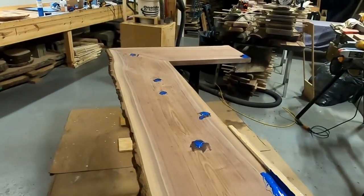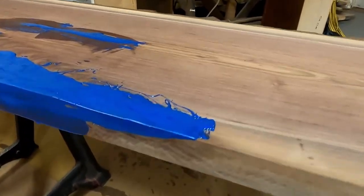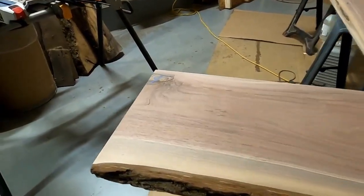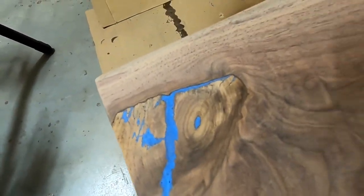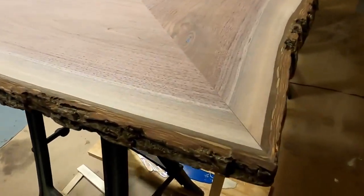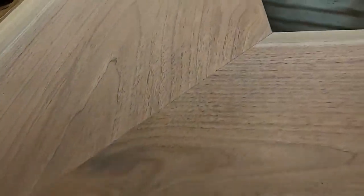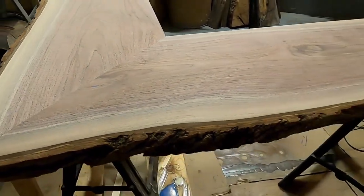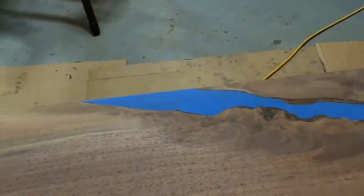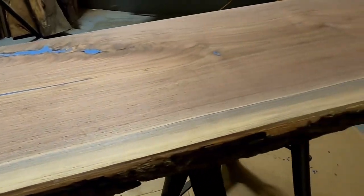This is 15-minute quick coat epoxy — it's pretty loose but you have about 15 minutes of working time and you really have to move. Once I took the MDF off, what you're seeing is a sharp edge along there that'll be sanded flush and is going to look really good. After sanding down, it's a little white but that's from the sanding — once we put an epoxy coat over it, it's going to fill in the actual scratches and you won't be able to tell. The crack has been filled with some wood glue and sawdust. I also took a chunk of walnut bark and fixed that corner, sanded it down to make a little better match. There are just a couple of little spots of blue here and there, the soft knot hole will be filled with epoxy as well and hardened up, and there's the bark inclusion — it ended up looking pretty neat all along there.